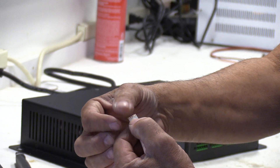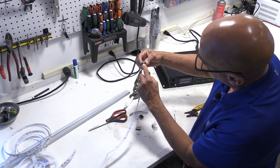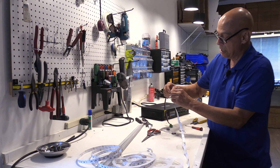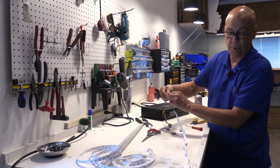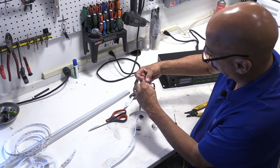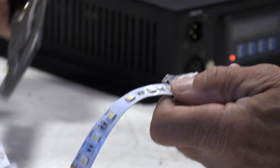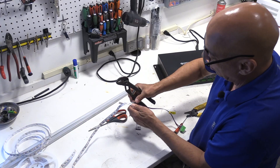That way the contacts are visible. When you put this in — if you look inside all these connectors — there are five little pins sticking up. The plastic compresses down making a firm connection. You want to go in not too far out or it'll fall out and not make a connection, but if you go too far in you will short it. Put it right on top where you can feel it sitting on the five little pins, then close this down with your hand, applying good pressure from both sides. Once it's just about closed, use some channel locks and squeeze down on the edges — they will lock into place.